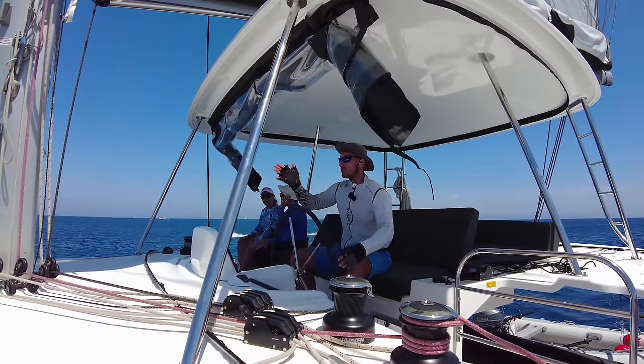Now you can see this catamaran behind. He just turns so much. You see it's swinging a lot left and right, putting a lot of stress on the anchor, taking more space. Another reason is also because, as you've seen, the chain doesn't come from the front of the boat, but a little bit in. So the leverage is totally different, so it makes it worse. So you can now see the boat is turning back and it keeps swinging. If you take a look at our boat, we are hardly moving, you see. We just go a little bit left and right. But now you can see how their boat is going in this direction and then it's gonna turn back. But let's observe.